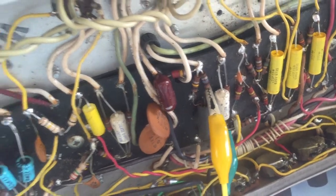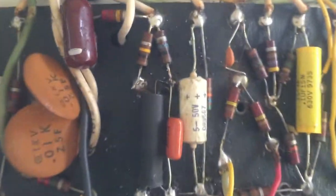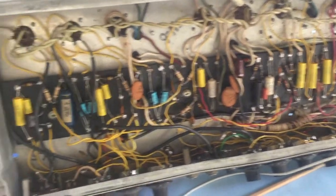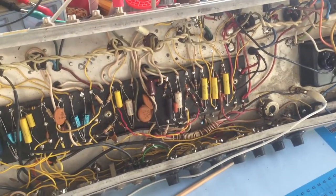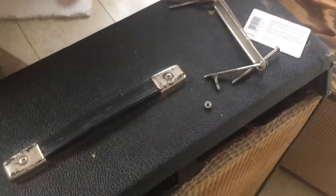Okay, we'll be soldering this in. Okay, that capacitor is installed. Let's try it again and hope it still works. It's another one of those amps that doesn't need the standby because it's tube rectified, and by the time the rectifier has warmed up, filaments are receiving current. No ticks. Nothing. Okay.